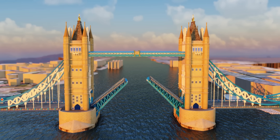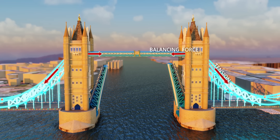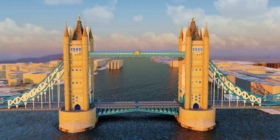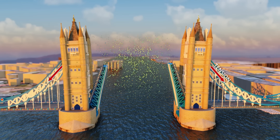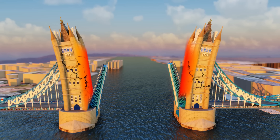The high-level walkways are not only there for pedestrian convenience — they also play a major role in balancing the force acting on the towers. To balance the horizontal component of the main cable's tension, the walkway structure must develop a tensile stress. Without the walkway, this part of the tower would have bent, and this portion would have been in tensile stress, causing cracks to form within only a few years of operation.